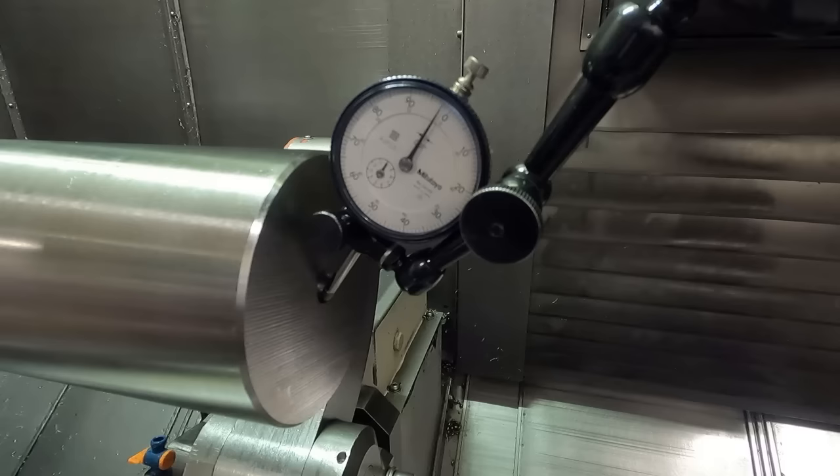See, the hole isn't in the shaft, or none of these holes, at the time you put it in the chuck, so it's kind of tricky to get a part like this in the chuck. And this kind of helps a little bit, because if you get the bushing started about this far into the jaws with the part sitting kind of like this in the spindle, you can pull the strap out and then you can kind of slide it up in there and straighten it as you tighten the chuck jaws. So oddly enough, that kind of helps that too.